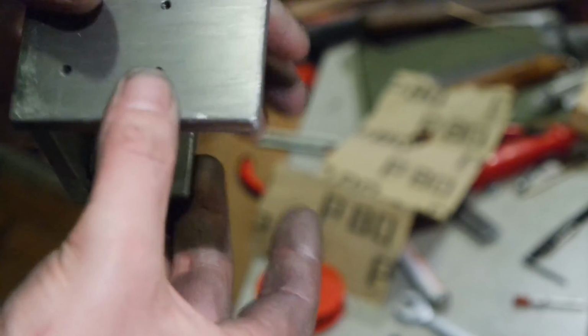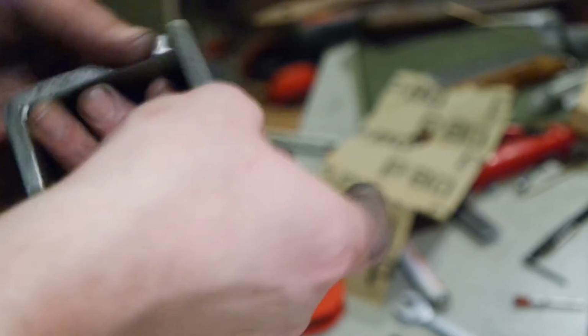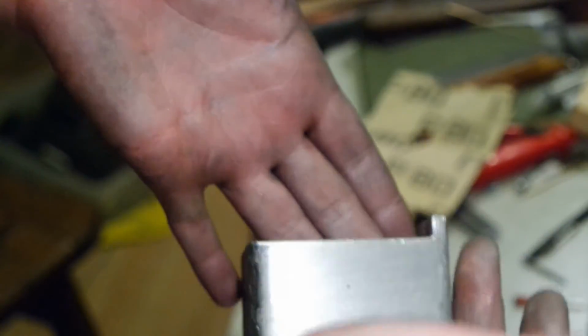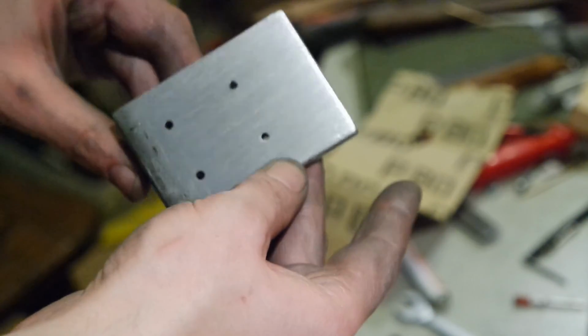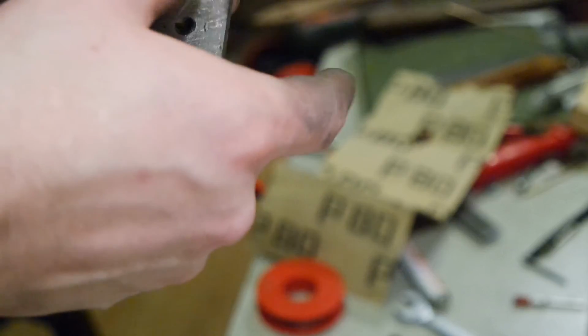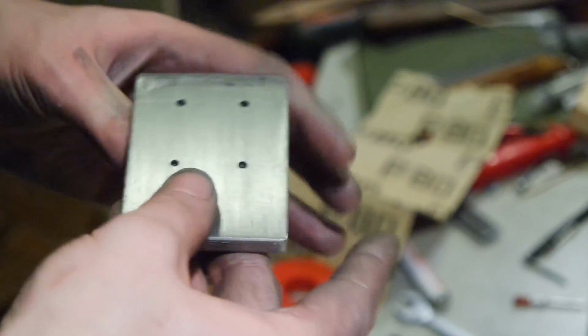I had to wait for an opportunity to weld, and in the meantime I've been busy with other stuff. Was making stuff for the hexagon. I picked up my cube project, but I made the bracket, and I've practiced my draw filing on it. Top is nice. Welding is a bit sloppy. I'm not a good welder, and haven't welded with electrodes in a while, and now I tried again. But this bracket should hold the lamp. And it's got 4 holes, tapped M4. Gotta find some screws, and have to make a clamping bolt, which fits here.